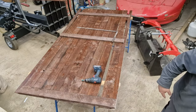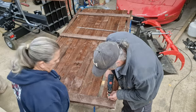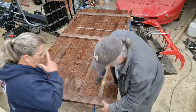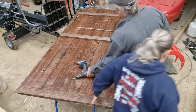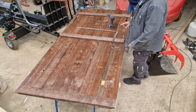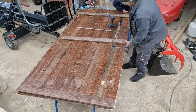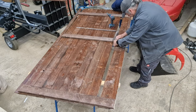And Rachel's back. So these screws, I'm going to stagger a little bit. And then we're going to go down to the other end and do the same thing down at the other end. Actually, we're going to do the middle first so that I can pull some of that pucker out of the wood. So Rachel's going to hold that end together for a minute. Then I'm going to find my mark here, make sure my wood is in the center. You don't have to smash them, dear.